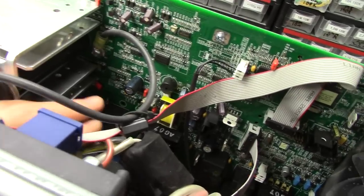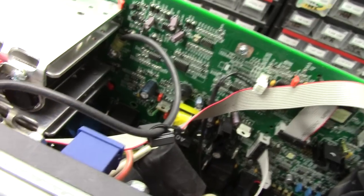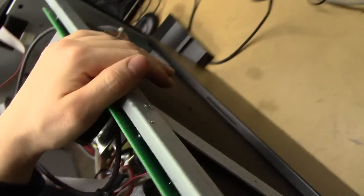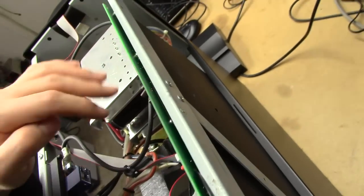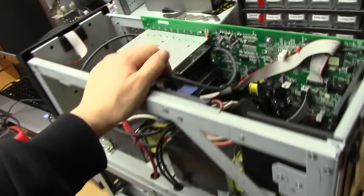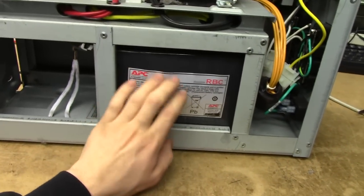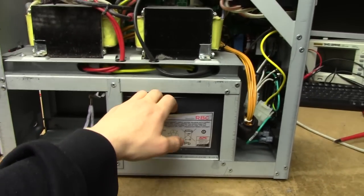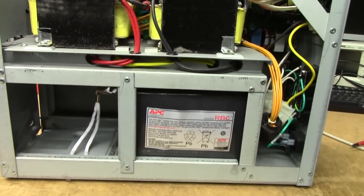It's got some corrosion down in this voltage regulator here, but it looks pretty okay. And there's nothing really on the backside of the board looking bad, because it's covered by a plastic sheet, and I had a look underneath, it's entirely clean. So unless this thing was actually scrapped for some internal malfunction other than having a broken battery stuck inside it, I'd say this thing has a decent chance of powering up as it sits.